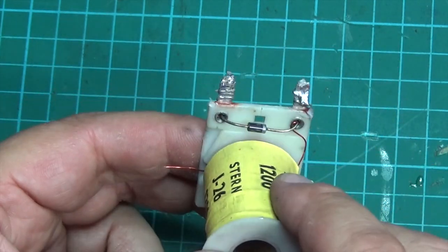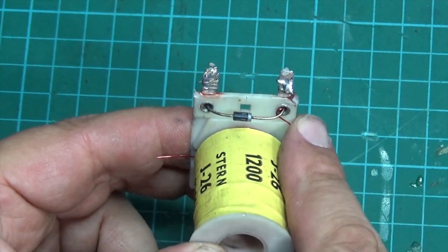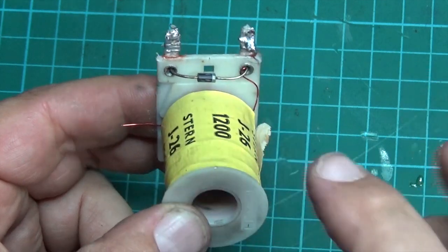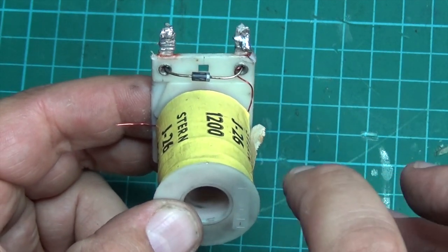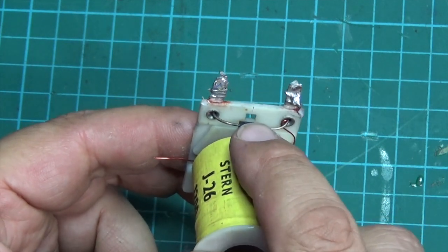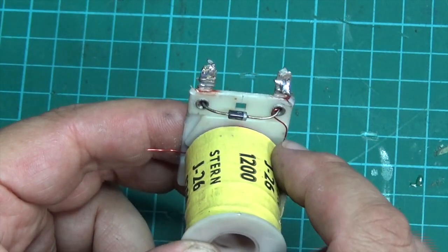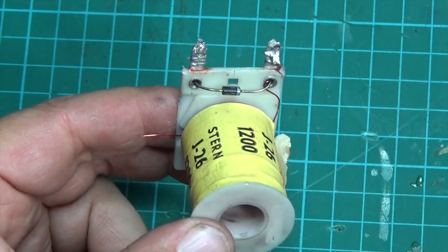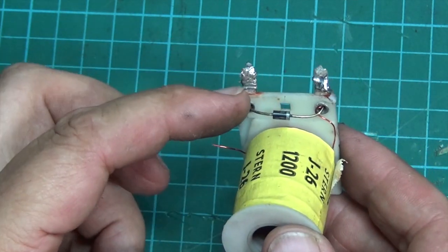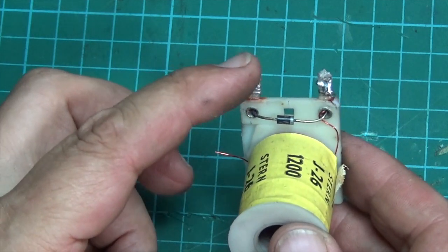after it's fired, there's like a residual charge which can, because it's charging quickly, energizing, and then when it discharges, you want to stop that charge going back to the transistor and force it out to the ground. So that's why you use the diode, which stops the power going back to the transistor.